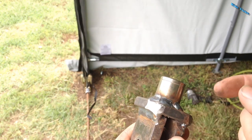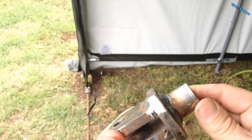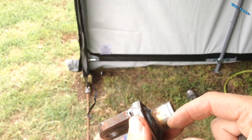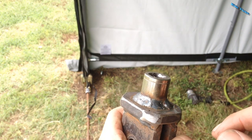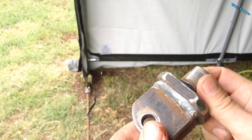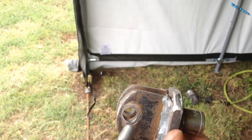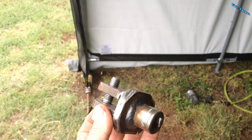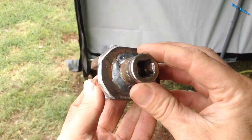This is a socket — this specific size happens to be three-quarter inch with a half-inch drive, but it doesn't matter what size you use. This one actually split on me because it's just a cheap socket, and it works perfect in here. I drilled the hole through the top plate the size of the socket and welded it on. I did grind off the chrome before welding — it's just MIG, no special wire, nothing. It'll hold to that socket just fine. The bolt is to keep it from sliding out of the loop of the anchor.